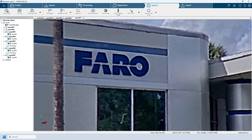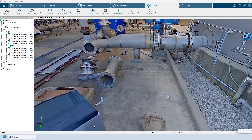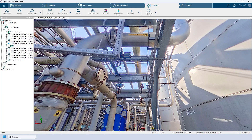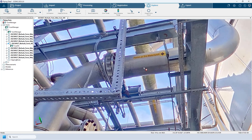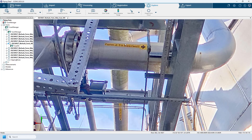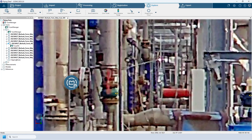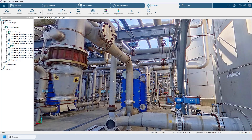That means for certain jobs you're going to use the internal, for other jobs you'll use the PanoCam, and for some you'll use both — you can always switch back and forth. Here's one more PanoCam example of a piping area, more like what you'll actually be scanning. You can see this has a really good calibration scan so everything's lining up. Zooming in further you can see the resolution difference. It looks really good close up, and of course if you want something good you scan close to it. The PanoCam is a very good tool — know when to use it and when not to, and make sure you understand the PanoCam calibration scan, which is very important to correctly align the PanoCam with the data. With that, you can start scanning with the PanoCam and practicing.